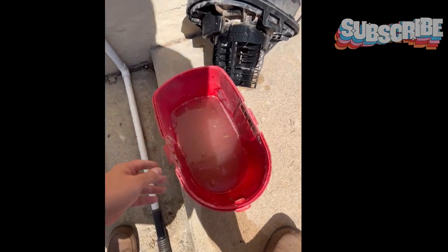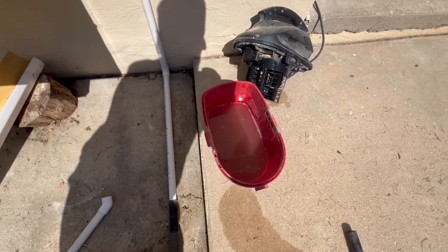You can see we actually got — yeah, it's probably about three quarters of a gallon of water in there. The reason we do this — cleaning out the lines once a year — it'll build up a sludge, and if you just let it keep building up, eventually it'll back up and you'll have water coming down the walls inside your room. To make sure we don't have that, I do this now. We can still run the AC a little bit more so it still creates that little vapor barrier so cold air can't come back up the tube in the wintertime. We're not putting the filter back quite yet because we're going to let it dry out for a day or two before we do that.